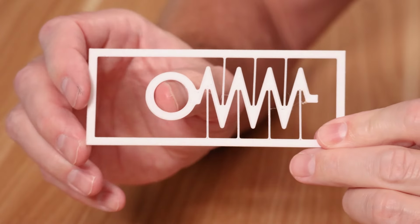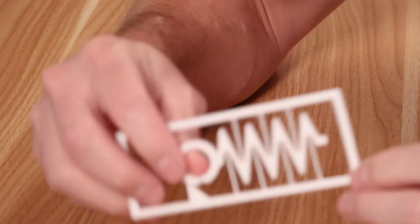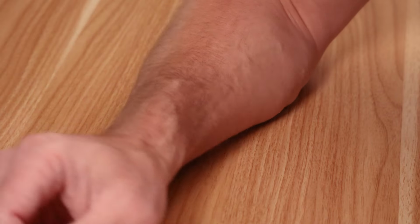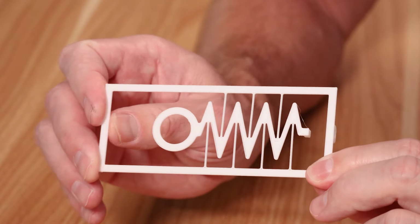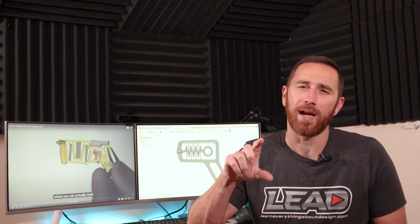Looking at the way that they did their design, I thought, well, I surely could simplify this a bit. So I initially started with a simple repeating V shape with just a single spring in between each V. I played around with different widths from 0.4 to 0.8 to 1.2, which is 1, 2, and 3 traces of the 3D printer. And I figured out what my limits were and what the overall range of sizes was that I should work with. What I ended up with is that 2 traces, 0.8 millimeters wide, and an overall height of 1.2 millimeters gave me the best results.